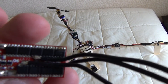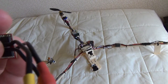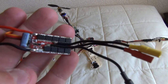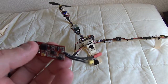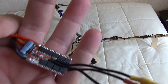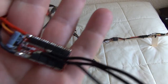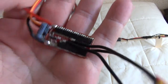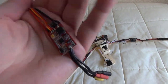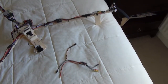On those little FET boards, the first three from right to left have some damage — specifically that end one, you can actually see it's browned up. When I got back to dry land I plugged this in; I dried the motor up as best I could, plugged it back in, didn't really dry it enough, and it went up in a puff of that telltale smoke. It still stinks actually. I'm going to strip out the wires — I might need them for something else.